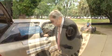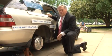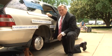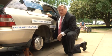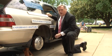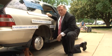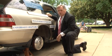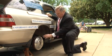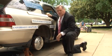Let's take a closer look at the electric motor. The real innovation in this technology — being able to convert any car to a plug-in hybrid automobile — is how do you add electric traction. There have been many approaches to this. Some involve interrupting the drive shaft on a rear-wheel-drive car; others use a technique where they drive through the lug nuts. But we wanted a technique that was transparent visually and also performance-wise. So what we have done is taken the space that exists around the rear wheel brake structure and packaged a DC brushless motor.